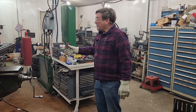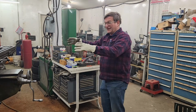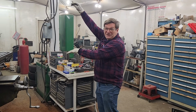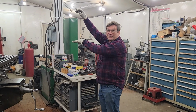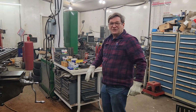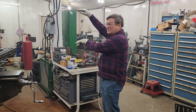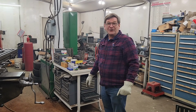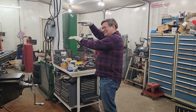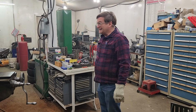Anyway, what I did, I had a surplus 16-inch air cylinder. I hooked the air cylinder up with the forklift, held it up with the forklift, and put air to it and adjusted the regulator pressure so it just took the weight off of it. I cranked the table a little bit, back and forth, moved it around so I could see whether I was fighting it or not. When I got it to where it would swing and move a little bit and be about right, I figured that's the right air pressure for it. And so I aired it up, we'd move a ways, then I'd block it, move the forklift over, go a little bit further, and work it back and forth and get the thing done. And it worked out pretty good.